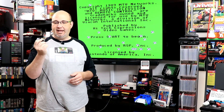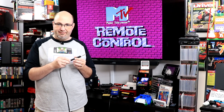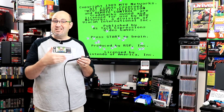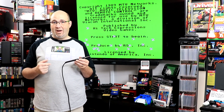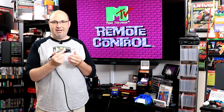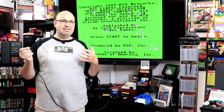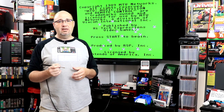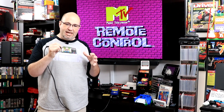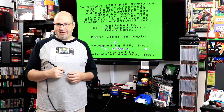On the aluminum handle — it is comfortable and slightly thinner than the plastic one. I have noticed that I feel more heat radiating out of it than from the plastic handle. If you want to insulate yourself against that, you can use tennis racket grip tape or BMX handlebar tape and wrap the handle — but at that point you kind of defeat the purpose of having the aluminum handle. I don't know that the aluminum handle is any more or less accurate than the plastic one; it just feels more quality, and when you're working on fine components, you feel more competent as you're soldering with it.